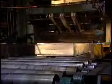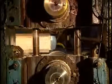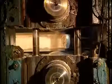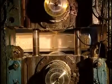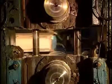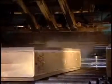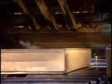The many steps in the thinning of the ingot begin. The aluminum block is crushed by the hot mill rollers. Temperatures in the rollers are between 455 and 540 degrees centigrade. Pressure on the ingot is continually verified by a technician. If too great, it's lowered and the technician then adjusts the pressure.